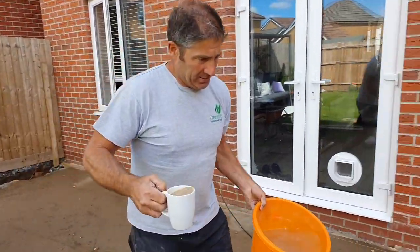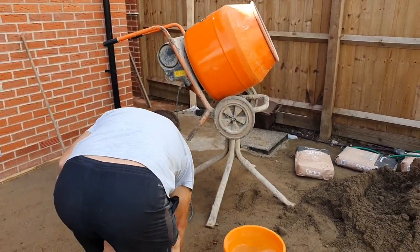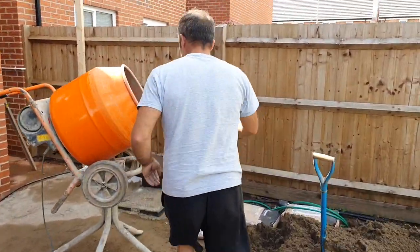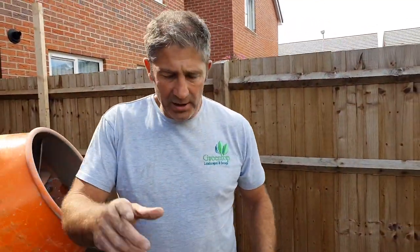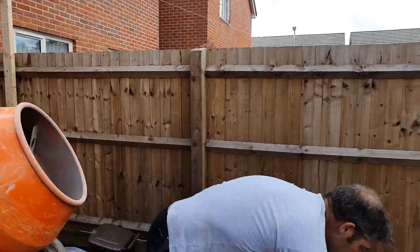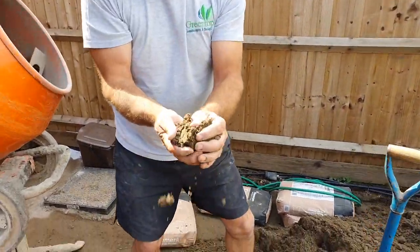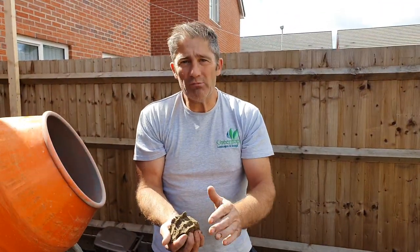Lost my handle. So, what we have here now, we have the sharp sand, 5 to 1, 5 sharp, 1 cement, okay? We do put the feb in first with the sand, because if you look at this sand, this sand is moist, okay? It's moist. Has it got enough moisture in there? Well, we don't know yet, do we?